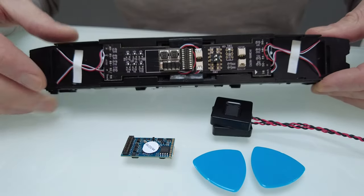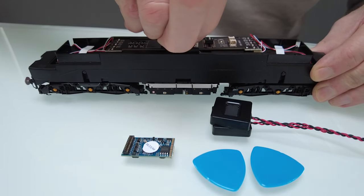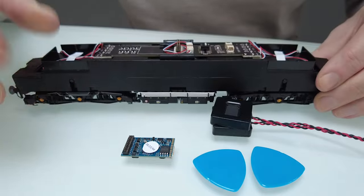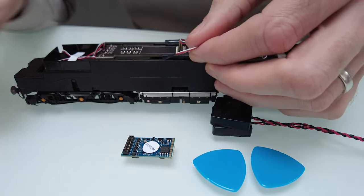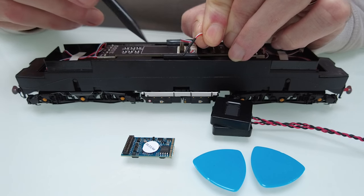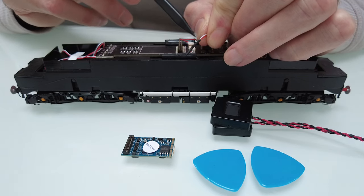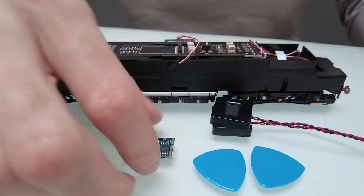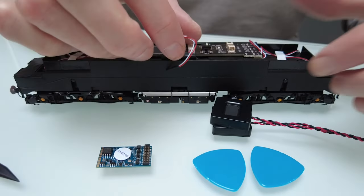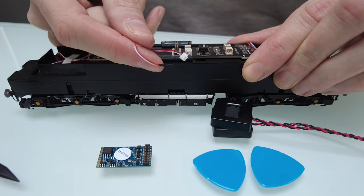Once you've got the body off you'll see that there's a 21-pin socket, so I'm gonna take the blanking plug off and move that out of the way so you can see your socket there. You'll also see that there are some wires — they're heat-shrunk and insulated at the end, but those are actually your speaker wires. You can cut that off, expose some of the wire, and solder your speakers onto there. Or if you're buying a decoder from me with the speaker already fitted, you can just unplug this and carefully take the little socket out — you don't need that part at all anymore.